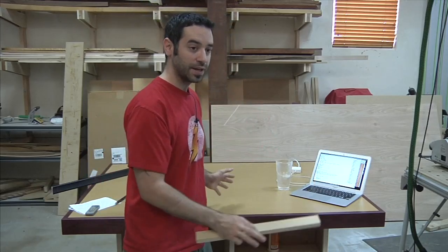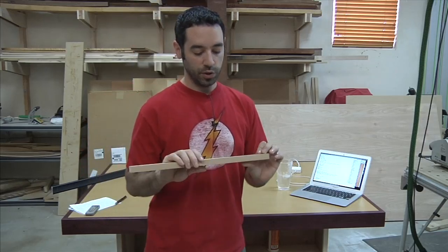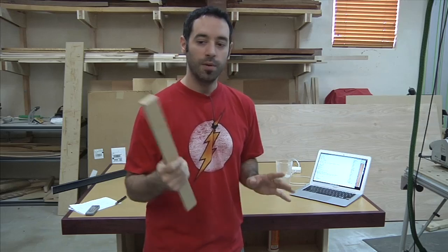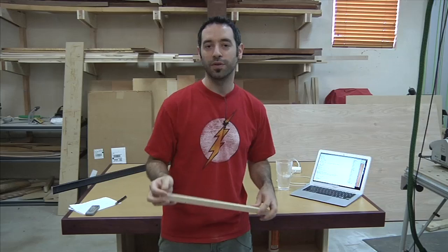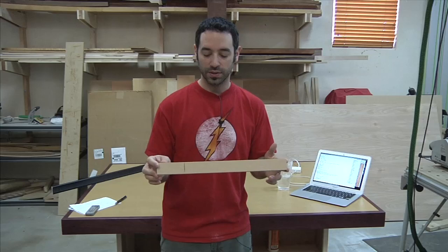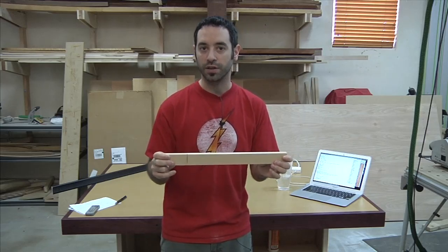I figured, let's make it out of ultralight MDF. Because it is lighter, it tends to be not as structurally sound — but this is MDF used as an internal grid work that won't have specific stresses relying on it being super strong. It's kind of like an eggshell — you can't crack it when you put pressure from the top and bottom just because of the physics. The materials are fairly light but the structure itself is very, very durable.